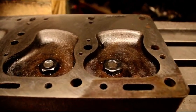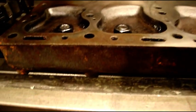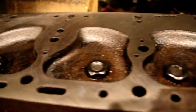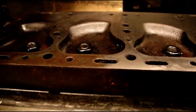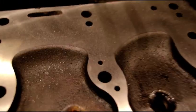After two-thousandths, we're getting a weird cut on this one — it's low right in this area and in this area here. I'm thinking this head may have been off the engine for a long time and started walking and twisting. I've got to get it flat regardless. I just rotated the cutters — this is a square cutter, so you get eight sides; four on one side, flip it and get the other four. We're going to go for another two-thousandths and hopefully start cleaning this up.